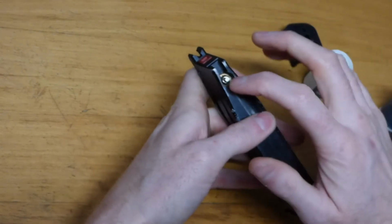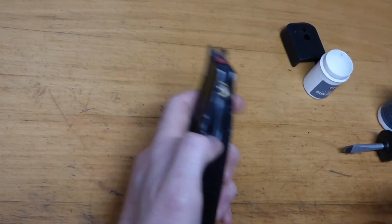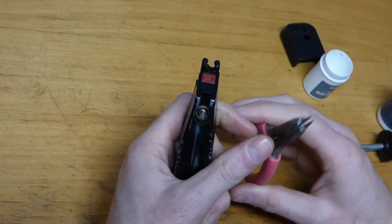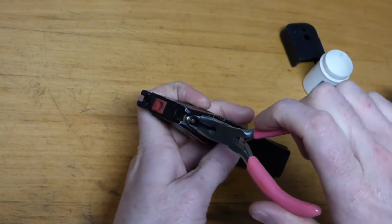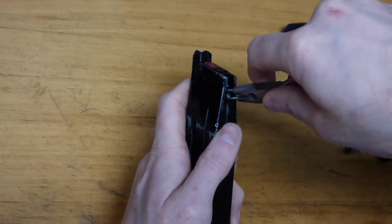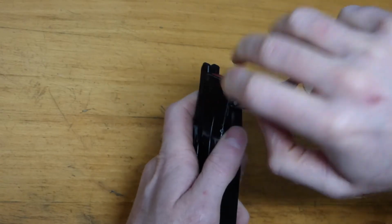And I am going to take this out here and just do those whilst we're at it. Now I made my own tool to undo that, so I just took a pin of a set of pliers with the round pincers, and I flattened them off so that they go in there perfectly. This is good for two reasons. One, it unscrews the thing, and two, when you want to lift it out, you just squeeze the pliers ever so slightly and lift the valve out. Quite good.